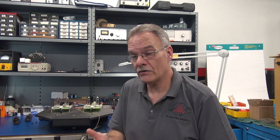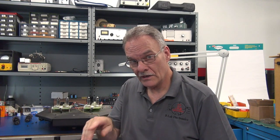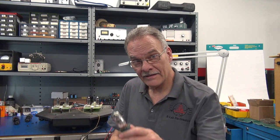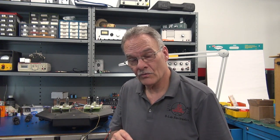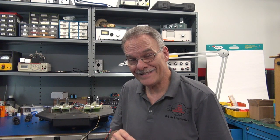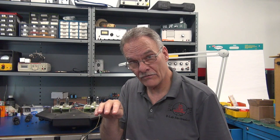And the only thing that I could find was a product review. It talked about the amp, it listed the tubes, and guess what? The preamp tubes are not ECC83s. This is actually a 12AX7. The stock tubes were 6922s, which cross over to ECC88. The filament voltage on these boards applies the power across pins 4 and 5.